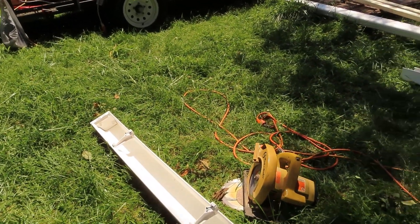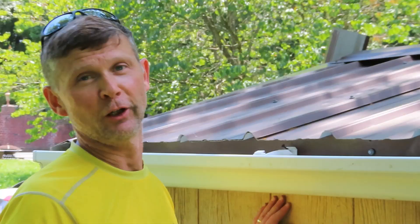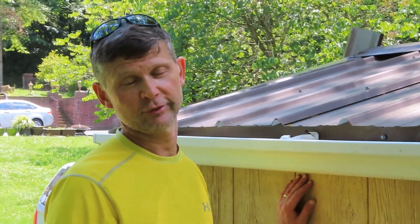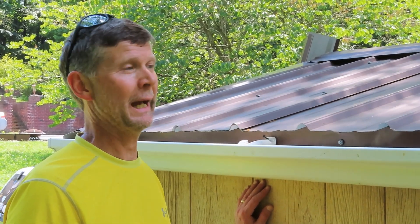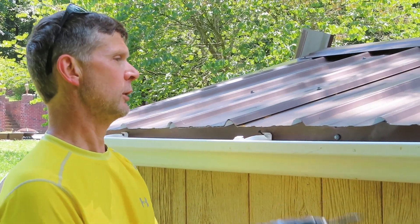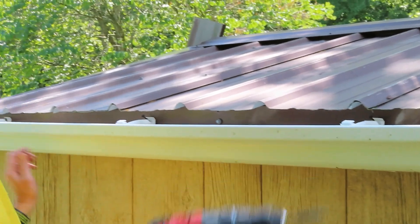We'll get a level and make sure we're coming down towards the downspout on the install. This is no comparison to the previous install — I wish we had had a ladder tall enough. So I'm happy with this install, much easier. We've got 12 inches already screwed in, then 24, 24, and then another 12. We put the two 12s in and Laura put a level on it to make sure we had some slope coming towards the downspout.